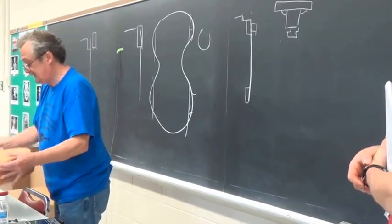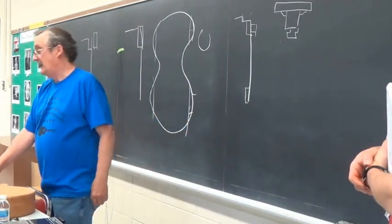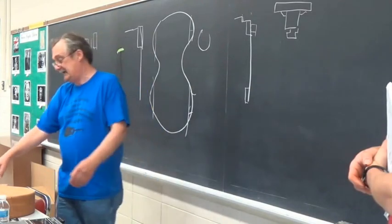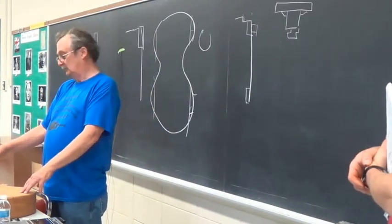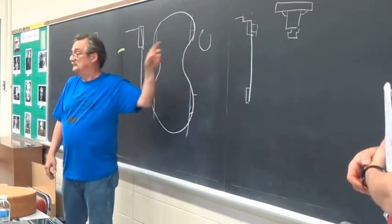So, to compensate this curve on the back, that donut will only contact a limited amount of points on the back so that you take as much of the curve and the taper out of the back as possible, because you want to try to keep your route as square and parallel to the side as possible.